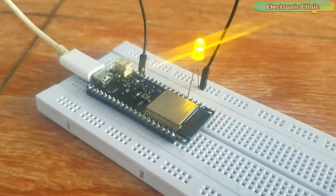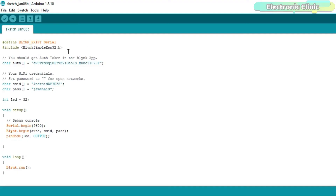Now let's control this LED using the Blynk application. The Blynk library can be downloaded from our website electronicclinic.com — you can find a link in the description. This is the authentication token, which I simply copied and pasted here. This is the name of the Wi-Fi router and this is the password. The LED is connected to the same GPIO pin 32. The setup and loop functions consist of the same instructions I've been using in all my NodeMCU ESP8266 Wi-Fi module based projects. I have already uploaded this program into the ESP32 Wi-Fi module. Now let's make the Blynk application.